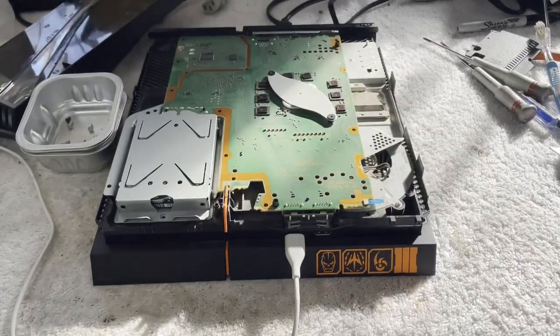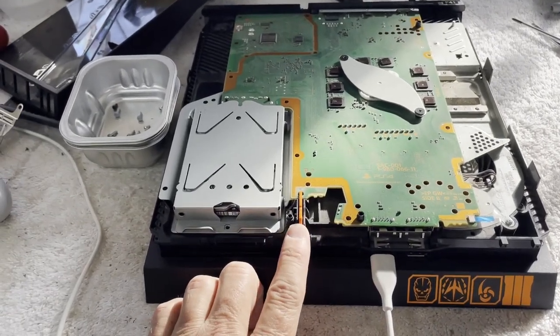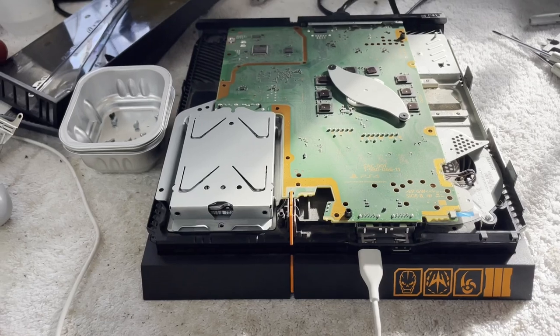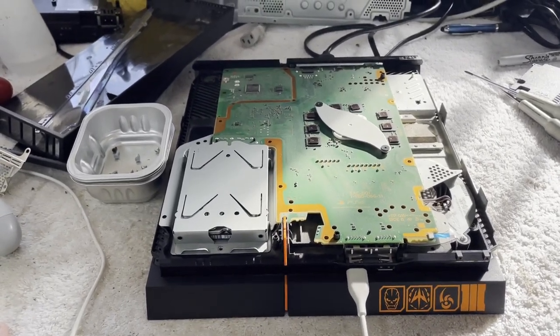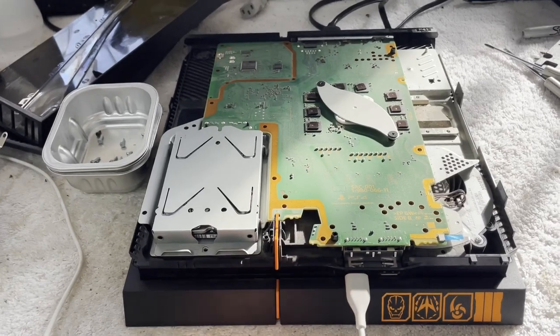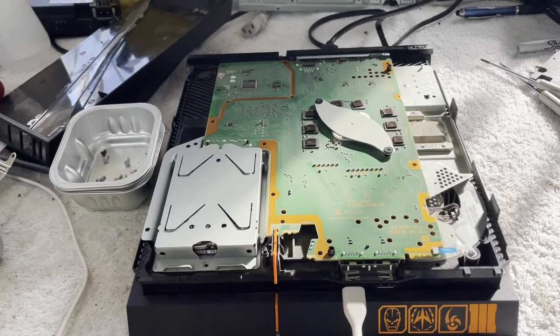Let's see what's going on. I'll let it unplug a little bit longer. She is brain dead. What I'm going to do is take the board out and remove the CR2032 battery — the little battery backup for the clock — leave that out and see if that makes any difference.